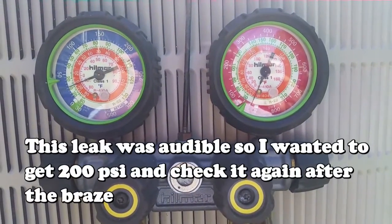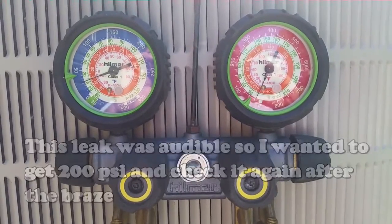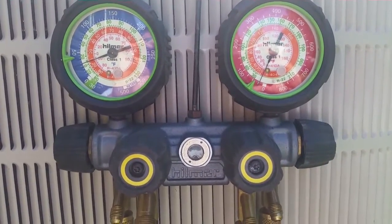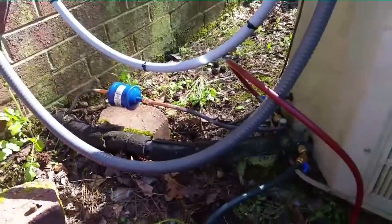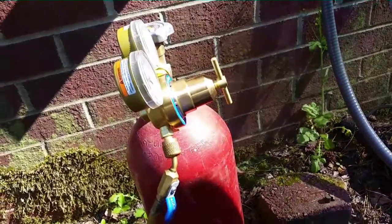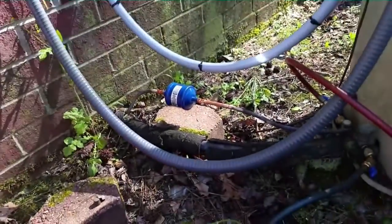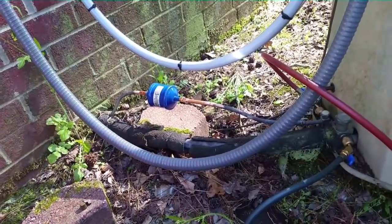We are now adding some nitrogen to the system. It takes a little bit of listening to hear what's going on. Looks like we might be running low on this bottle, so I'm going to pump what I've got in this one and go get another one. As I cut my old dryer out, I have my new dryer in. About to braze it up and flow a little bit of nitrogen while I'm doing it. I don't have my nitrogen flow rate dialed in, so I'll see if I can flow a low enough amount with the regulator.